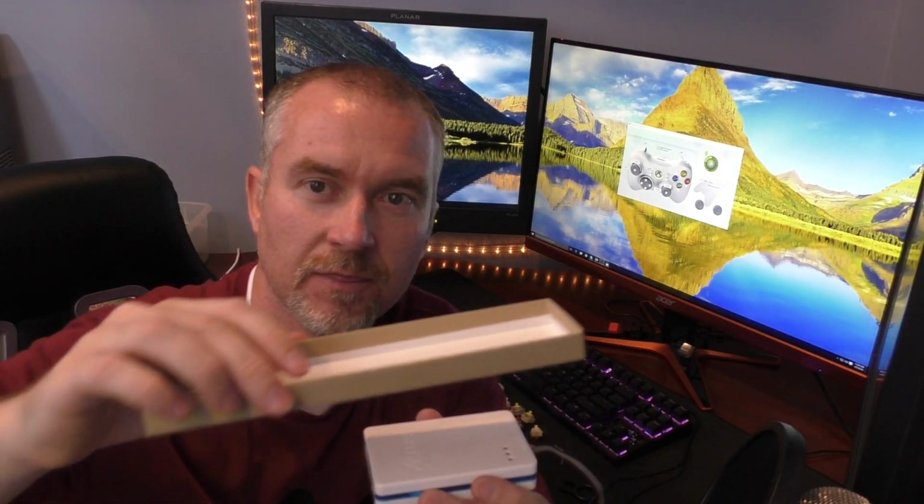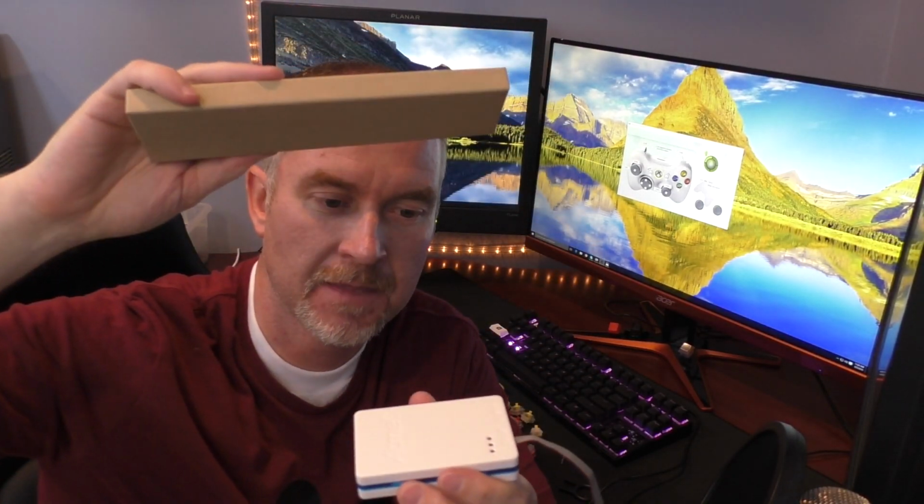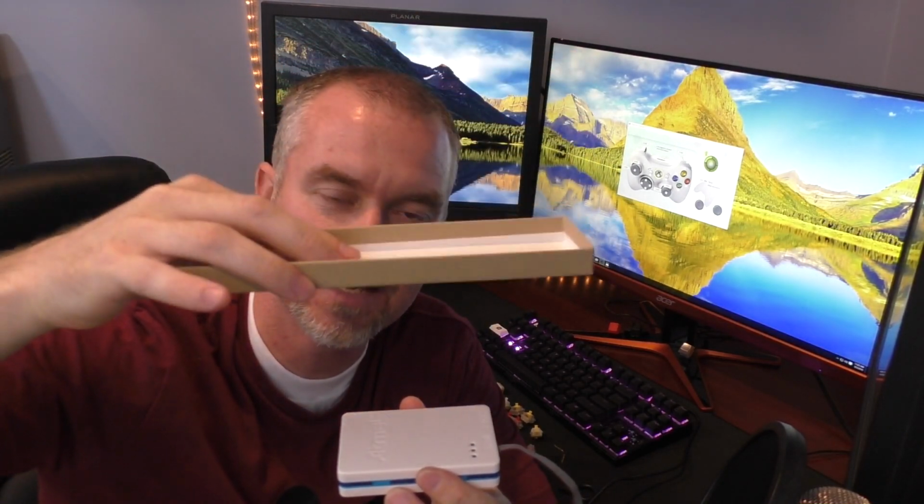But before I do that, I just want to visually demonstrate what's going on with these analog switches. If I use this as an example of what our sensor is, and the sensor is mounted on the circuit board of the keyboard, and then this represents the switch as you push it down. There are two parts of this sensor. One is shining a big old infrared light up at the switch, and then there's a sensor on the side that says how much light is coming back.